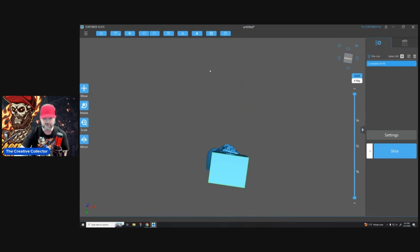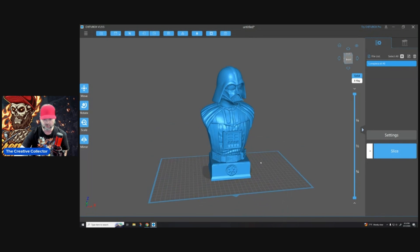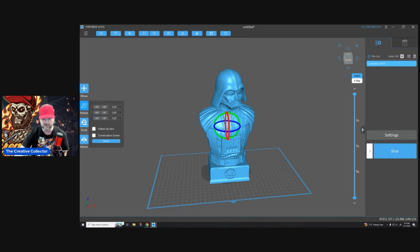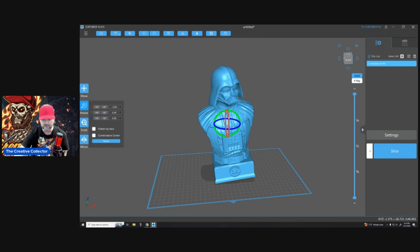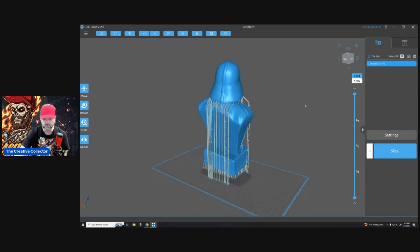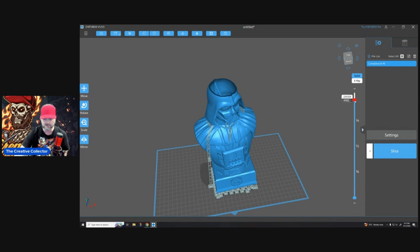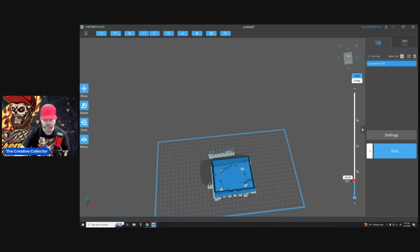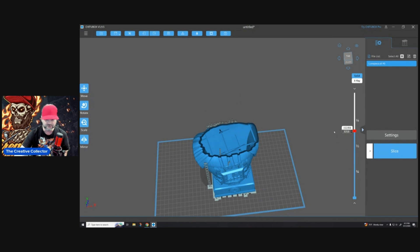Now I'm going to go ahead and put a couple of drain holes in here, then we'll add supports to see what it looks like. Let's put four drain holes in here. Now I'm going to orientate this model — tilt it a little bit, tilt it back slightly — and now we're going to put supports on it. Now let's take a look at the inside. There are no supports in there — the grid infill acts as a support. The system knows not to put anything in there, we still have this neat clean appearance, and again you're saving on resin.